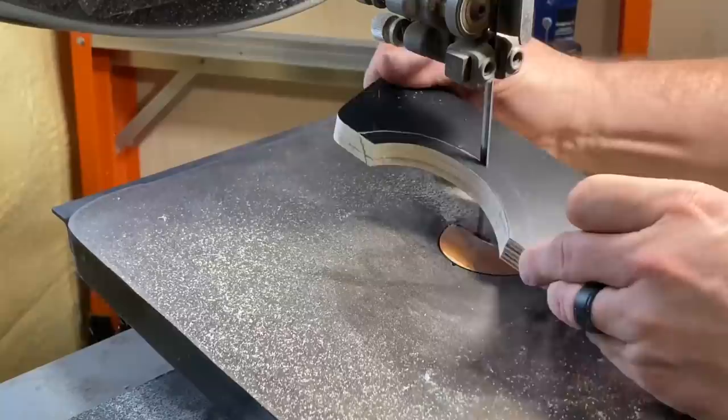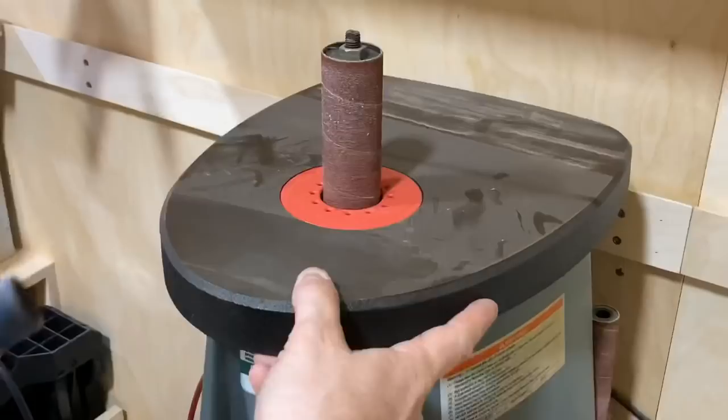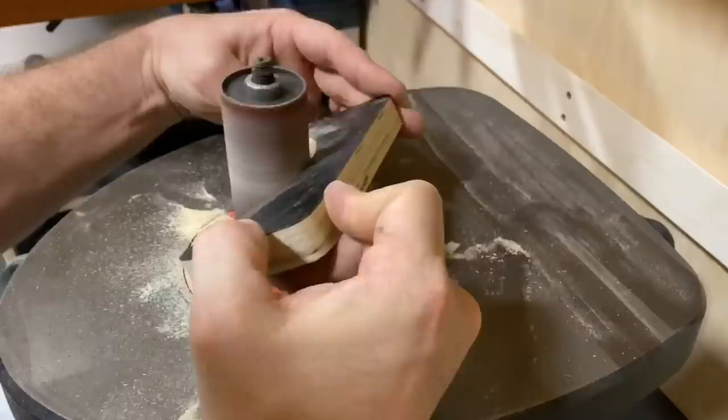So you saw me cut this piece on the bandsaw, a little semicircle out. I'm trying to make the sanding process a little bit easier, putting a 45-degree edge on that concaved piece. We're going to move our way to the random orbit sander, hook up the dust collection, and then just kind of make our way around this piece. I'm just making something that will soon become very clear. I've titled this video 'A Happy Accident' and I'm going to show you exactly what I mean here just in a minute.